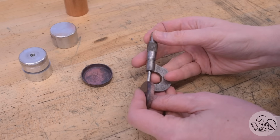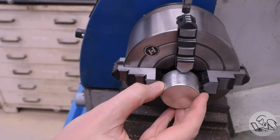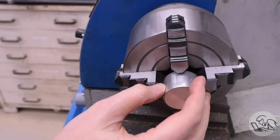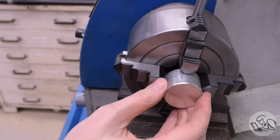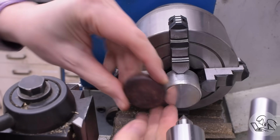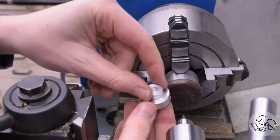From a practical standpoint now, though, we actually want to remove that excess metal. This would be mechanically necessary if we were doing a traditional interior head, but for the exterior head, even though the excess material is not hurting anything, it messes up the look of it, so I want to turn down that excess material. Conveniently, the hammer form is now a fixturing mandrel for the lathe and these heads. I'm going to use pressure turning for that.